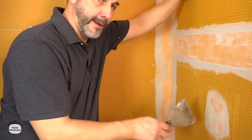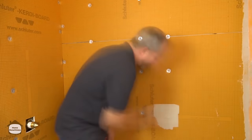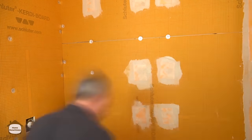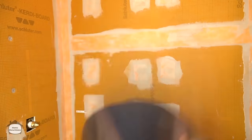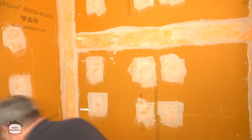Because the design is made for a 2-inch overlap at 40 feet below sea level, since we're only waterproofing something on the back of a shower, you don't have to be all that concerned with the math. If you're even close, as long as that hole is covered, even by a quarter of an inch, I'm telling you right now, you're not gonna have a problem, so don't get all paranoid about it.